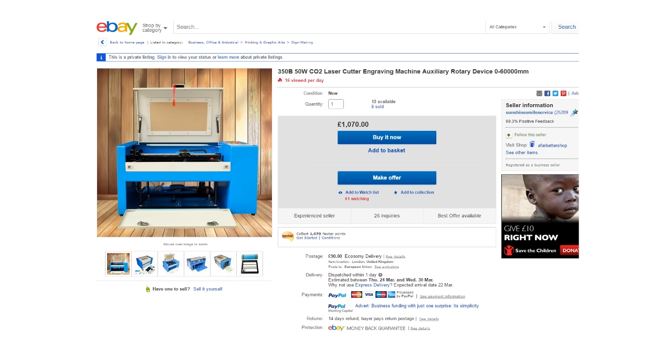But let's just come back to the picture that's in front of us. It clearly says it's a laser cutter engraving machine. Now, this particular machine that you see in front of you is definitely set up for engraving. I know that because the little red dangly bit down at the lid is a lot wider than a quarter of an inch, which would suit a 1.5 inch focal length lens. That's about 3/4 of an inch wide, which means that machine is fitted with a 2 inch focal length lens, which has been set up really for engraving.